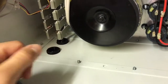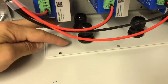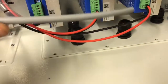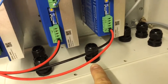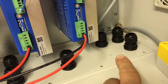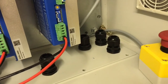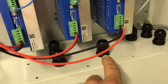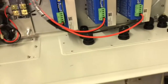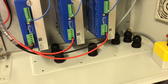Those two will sit here, so that will be a little four with all the cables running up here. Near the drives I'm going to have X and Y, so the wires will come out and down, and then from Y out and down, and then Z here. Over here I've only got a short gland at the moment but there's three there. There will be another little cluster of four, and that little cluster will have the proximity switches, the e-stop, and the limits all coming out of it — all 24 volt. This is the power going out to the motors from the drives and then all the high voltage stuff over here, so again trying to keep everything separate. I'm going to drill out all the holes next and then when I've got the rest of the glands, that will be those two gland plates complete.